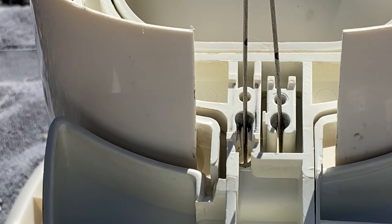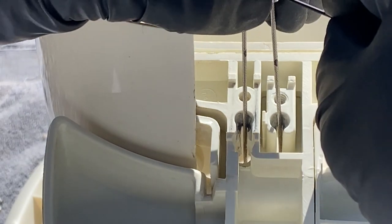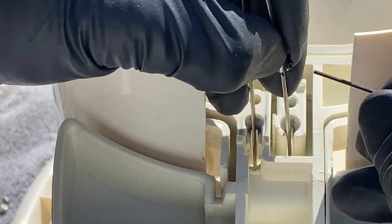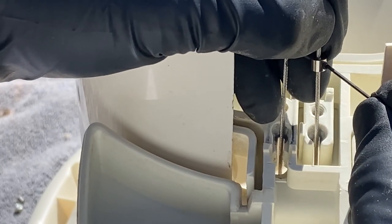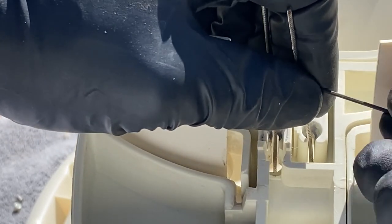Now you might meet a little initial resistance and you need to thread the collar on. So you go ahead and stick it on there. I'm finding that my set screw is maybe tightened a little too much. Release it a little bit. Align the bottom of the mark with the top surface of the collar. And then I'm going to tighten the set screw securely. Then I'll repeat the same thing on the other side.